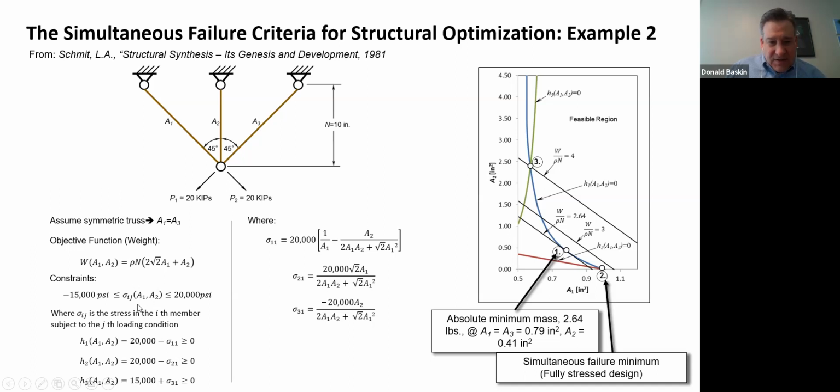We have these constraints for the stress that's in these different members. You can figure out the stress on these structural members. I guess I said before that it was intractable, I was wrong. What I was mixing it up with is that A1 equals A3 to simplify the analysis. But you can calculate the stress on these guys, given the loading condition of P1 or P2, or both,